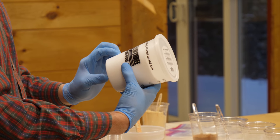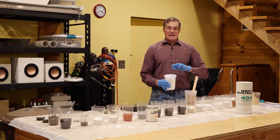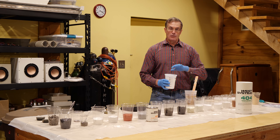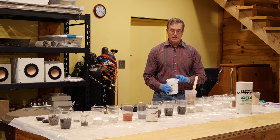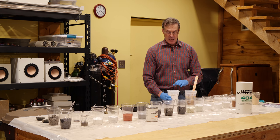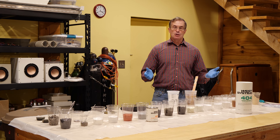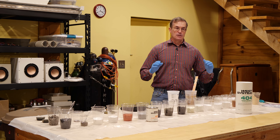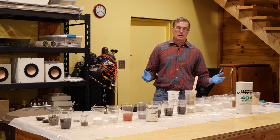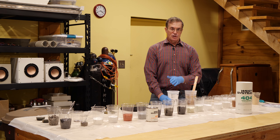This is a silica thickener called cabosil or fumed silica. It has a particle size down in the nanometer range, and because of that it has much more surface area per cc or per gram than the wood does — so a very small amount of this added to the mixture will thicken it up quickly. General warning: yes, you should always work with a mask and be very careful with these powders. For most powders that's good advice, but for this one it is particularly important.